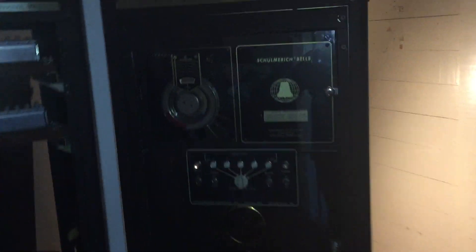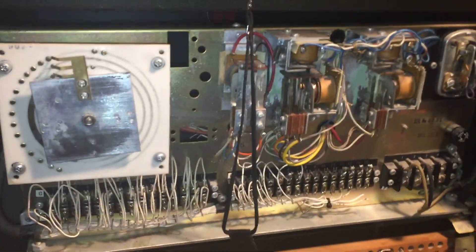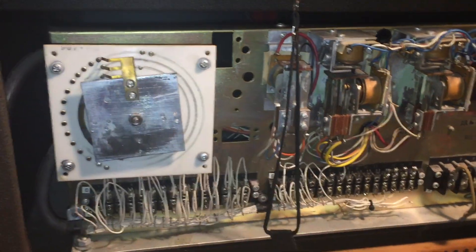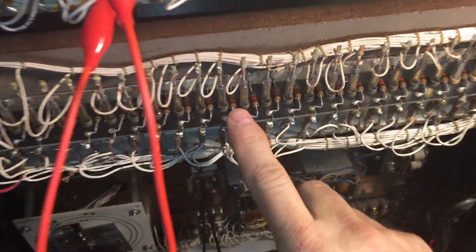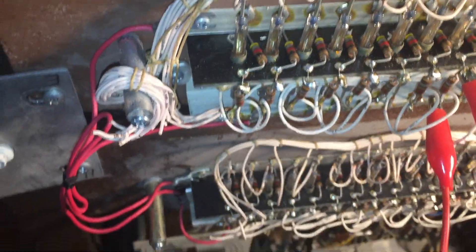Now that you've had an introduction to the front of the cabinet, I want you to look in the back at the electromechanical systems that are a collection controlling the bells and the harps. There are a lot of wires and a lot of switches and relays. There's a monitor speaker down there that you listen to as you're adjusting things. This is a wooden rack that has all the notes exposed so you can control them manually — these are the control electronics for the scroll player. And then there's an array of electromagnetic glass tube relays here, each one controlling a single note from a distant location like the organ down in the auditorium.